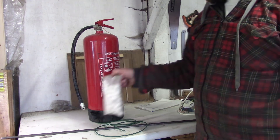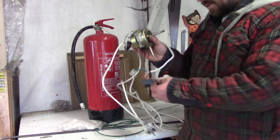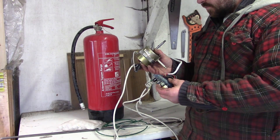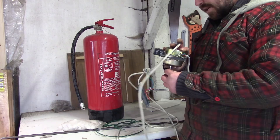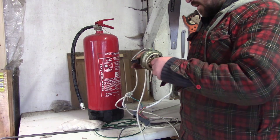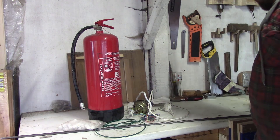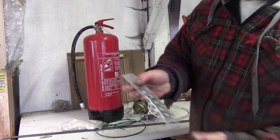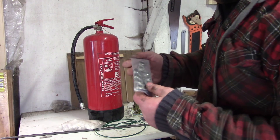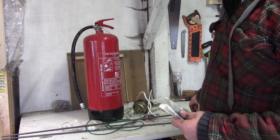I've got some ceramic ball grinding media — I don't think I've got enough there. I've got an electric fan motor. This is good because it's got different windings inside the motor so I can run it at different speeds. I'm not entirely sure how fast it's going; I should imagine it will be in the 600 to 1000 RPM range. It won't go much quicker than that because these are very quiet. So that will be reasonably low speed anyway, but we'll have to figure out what pulley diameters I'm going to use. And a stack of ball bearings — just the cheapest ball bearings I can find on eBay.